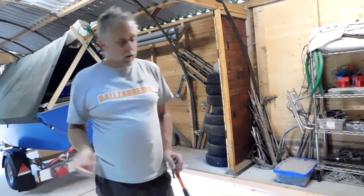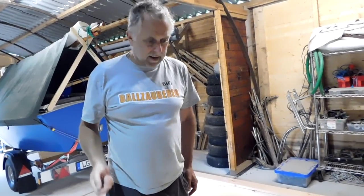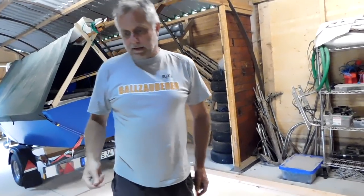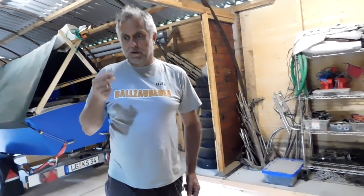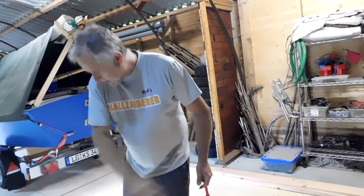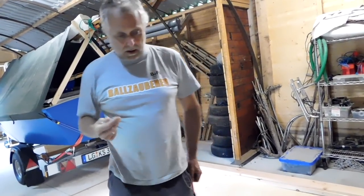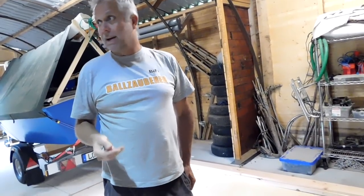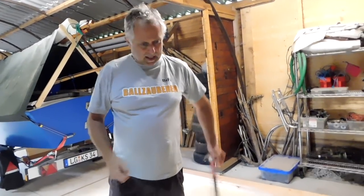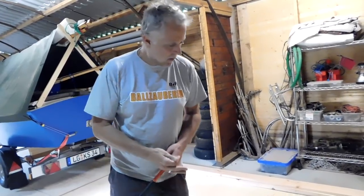That was one thing. Now, on the table of offsets, all of the measurements are based on a baseline that is actually the bottom of the keel. Now clearly I haven't drawn the keel here, so the first thing I had to do was to reduce all dimensions by that amount, so that the bottom of the chine curve fits my baseline. So I had to subtract 3 feet, actually I had to subtract 2 feet 11 and 3/4 from all of the measurements to get that. So easily done, you just take 3 feet off and then add 1/4 inch.